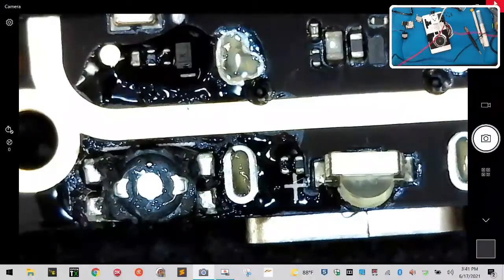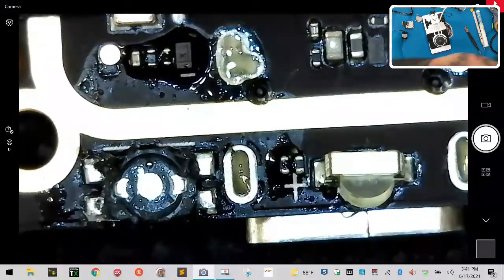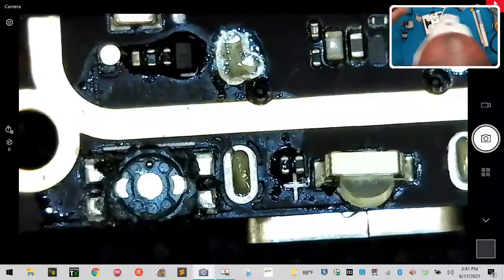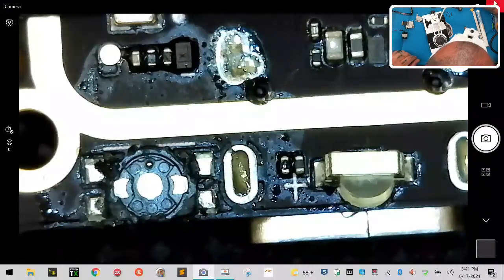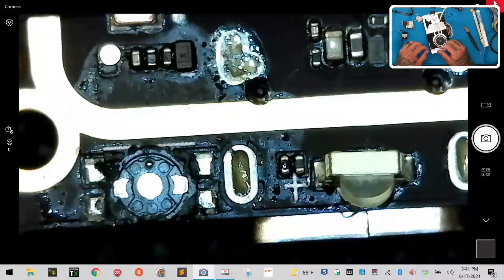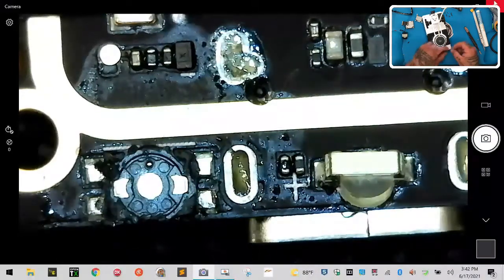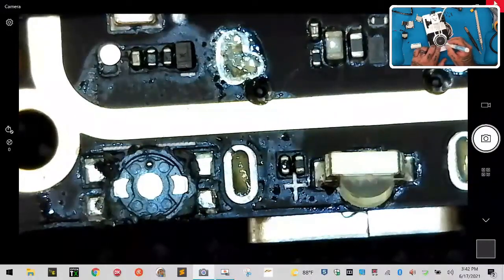So on there there isn't continuity, but on this side we should - excellent. This may be a ground - yep. So what we're going to do is this button would basically hover here and when we press it, it would link these - bind these together. So what we're going to do is use a flux pen and create our own little button so to speak. I was going to take the whole thing off but this is actually pretty simple to get to so we could do it this way and save ourselves a ton of hassle. We're going to get two very fine wires - like wires that would have come off a buzzer or something like that.